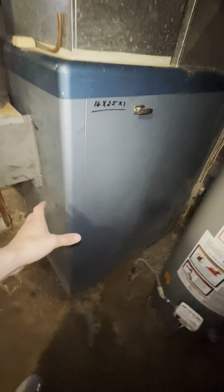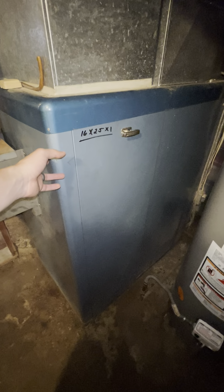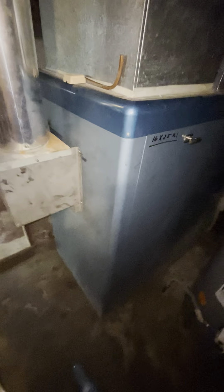What we'd like to do is engineer about five-foot runs of 10-by-20 ductwork and reduce that down — there's no reason we'll need a system this big. If we can put in a filter rack access right over here, this would be the easiest — it's just coming straight in and straight out, making it a lot easier for them. We're looking to do a 16-by-25-by-1 filter rack and access. If we need to put it closer to this side we can, but I'm looking for easy access. I'm thinking right here would be best.